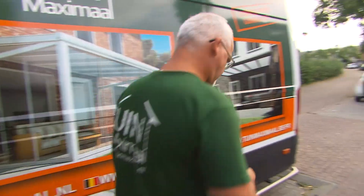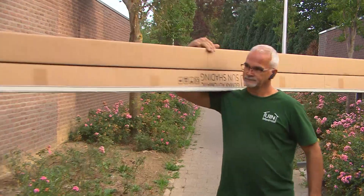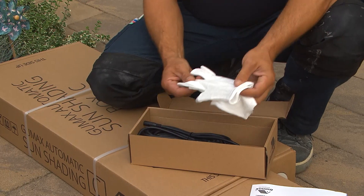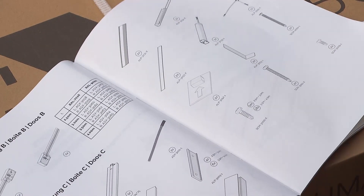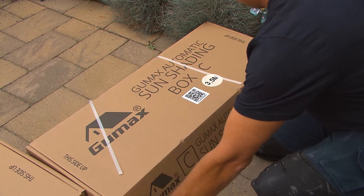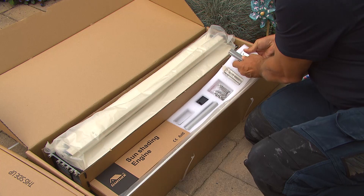To see what kind of sunshade you need, you need the length of the sunshade and count how many roof panels you have. After ordering, the blinds will be delivered to your home — you can take care of the installation yourself. By delivery, you will receive several boxes, including a general box where you will also find the instructions. Go through it beforehand. You will also receive one box with sunshades per track. The sunshade is placed under the veranda between the roof beams. Put them already at the track and check upon delivery that you have received enough.